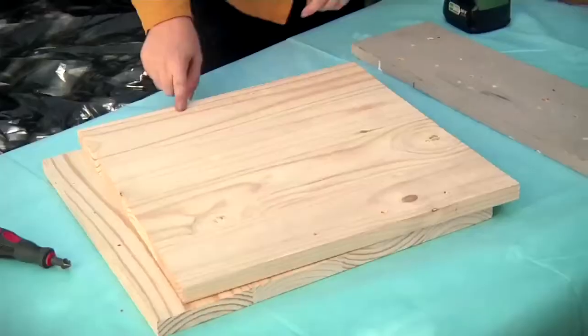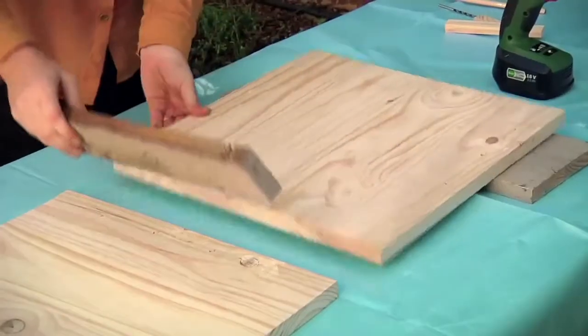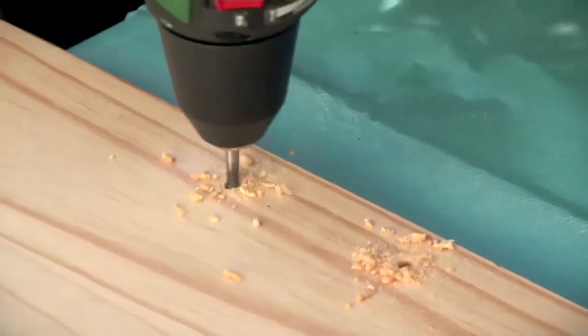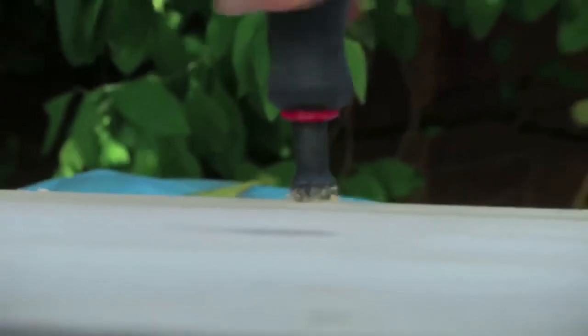As you can see, we've marked out where we should be drilling the holes for the nuts and bolts to pass through later to secure our sideboards to our braai. I've loaded my wood drill bit and I'm going to use a scrap piece of wood to drill the holes onto. The next step is to countersink my screw heads and fill with wood filler so the tops of the sideboards are nice, clean, and flush — using this clever little countersink hand tool.